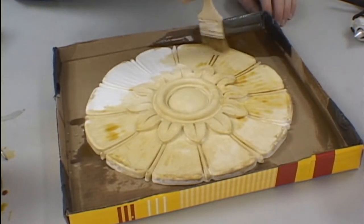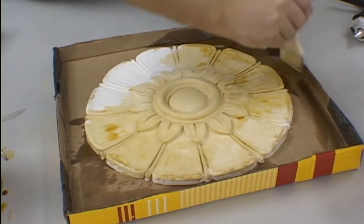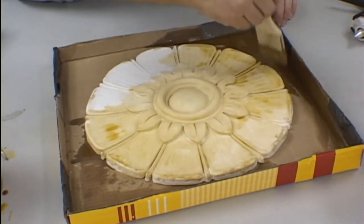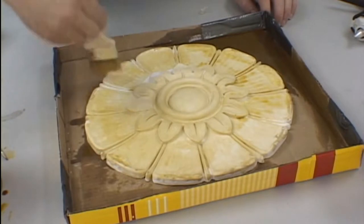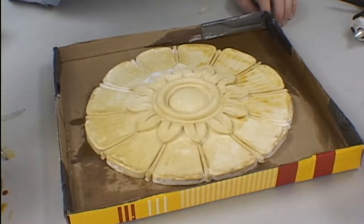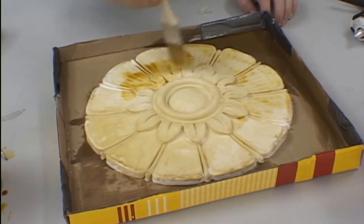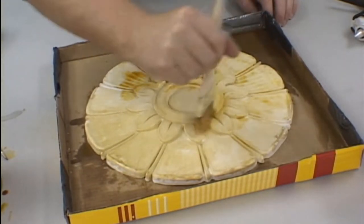It is also important when you're applying your shellac to coat the entire surface of the box as well. This will make for an easier release of the latex from the box during the demolding process. The shellac also acts to harden up the patches that you have done on your model. This will ensure that during the brushing on of the latex, you don't indent into any of the clay patches.